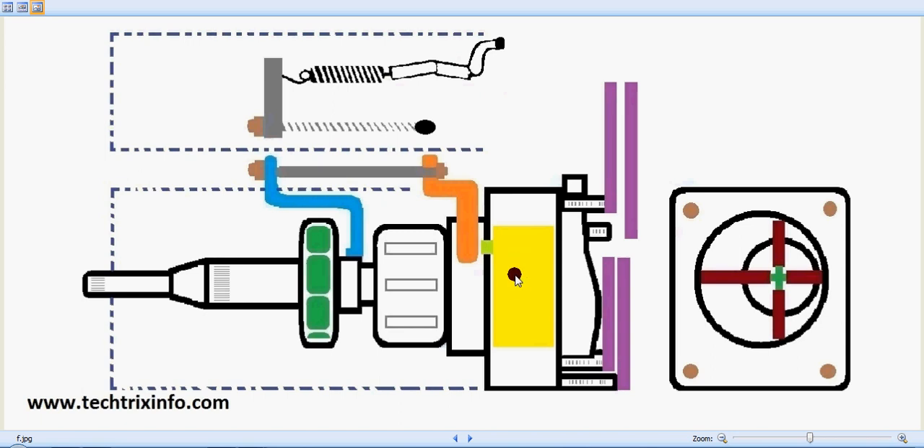The yellow color shows the internal view of the vane pump. The vane pump supplies fuel as it rotates — the drive reaches the vane pump, which rotates and supplies fuel through the gallery, through the metering valve, and that connection goes towards the injector lines. As the metering valve moves, the gallery is controlled by the rpm demand, which controls the fuel flow towards the injectors.